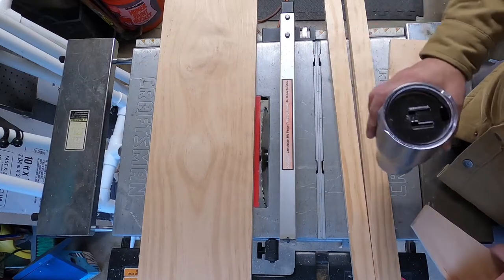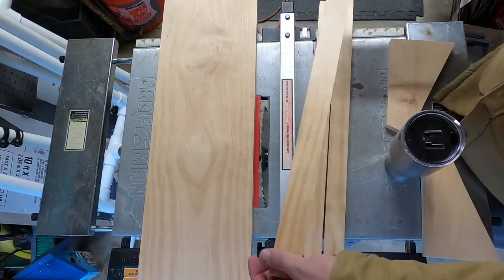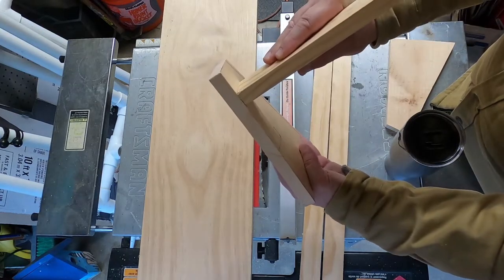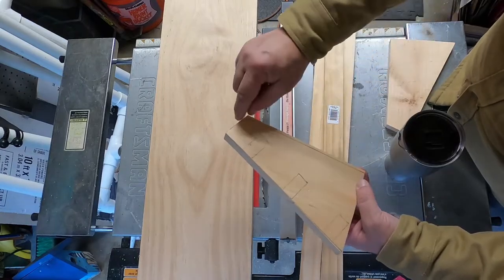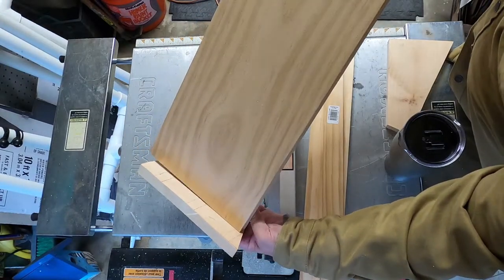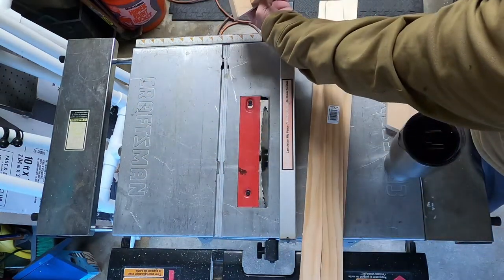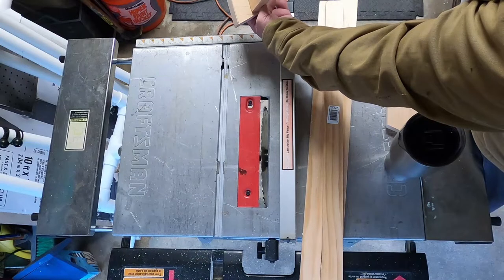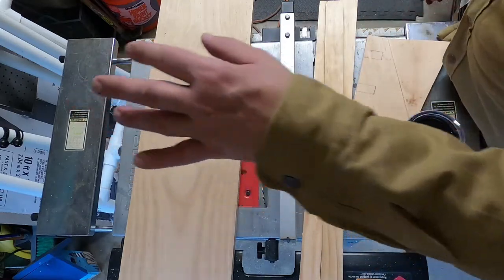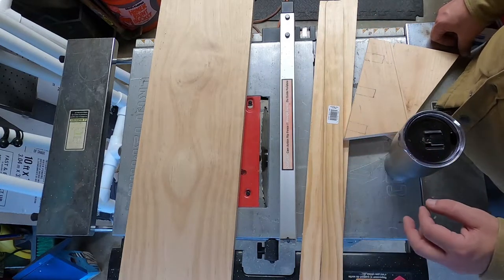Okay, so we've got our 3 shelves now. Rip those off. And you can see how I mapped on the piece. So it'll go 1, 2, and 3. Then I just need a backer plate. And that I am just gonna cut from this 1x12 piece. And that will mount on there like so. And then it's assembly time. So this will also be 26 wide to match the shelves, a couple of screws, a little bit of sanding.